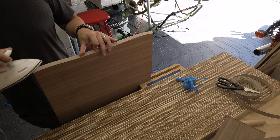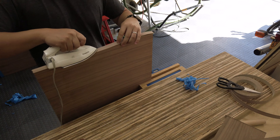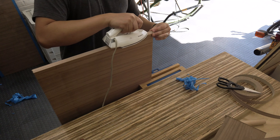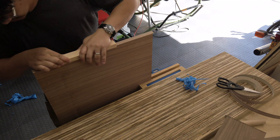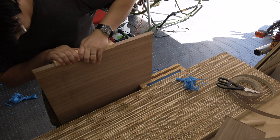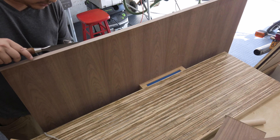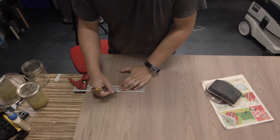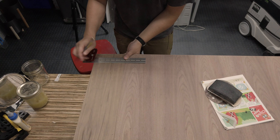This part is completely optional — this is edge banding. With plywood you can see the layers of the ply, but with edge banding I get a matching walnut edge band. You iron it on, the glue heats up and sticks to the board, and I use another piece of wood to help push it and make it tacky. Then I use a chisel to trim off the extra overlapping edge tape, though there are plenty of other tools that can remove it for you.